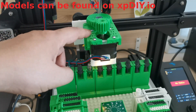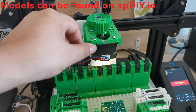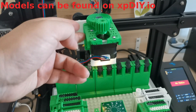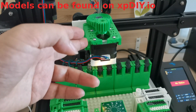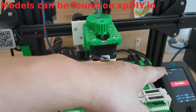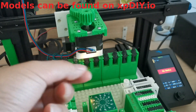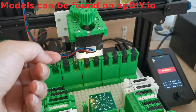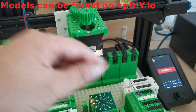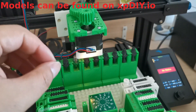So that's one improvement I made to the nozzle head. There are actually two ways to tackle the very hot motor problem. One is the design improvement I already covered, and the other way is to go into the machine and adjust the current of the stepper motor.